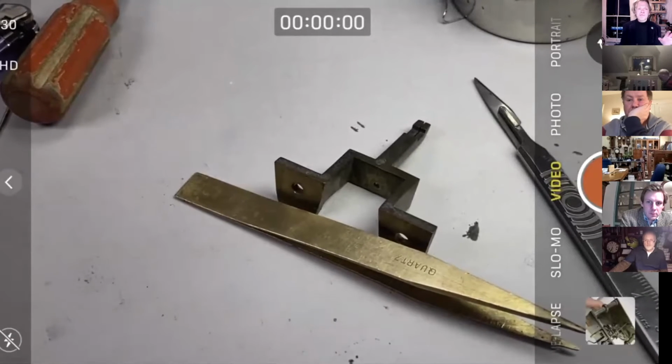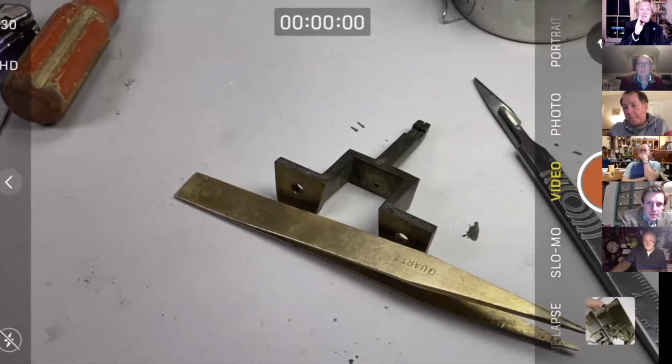So there's just a question about recapping on the crutch and the suspension spring. I won't do it right now because this refacing thing has gone on too long. So I'll press on with this for now, if you don't mind, but we'll either come back to it on Facebook during the week or we can make it part of next week when we do our re-pivoting. But basically, make sure that the top block of the suspension spring and the crutch are in line.